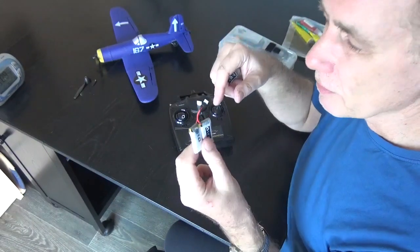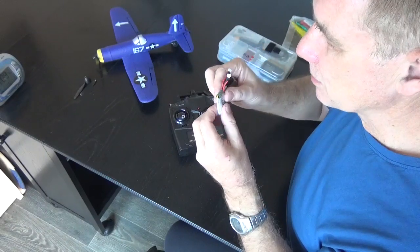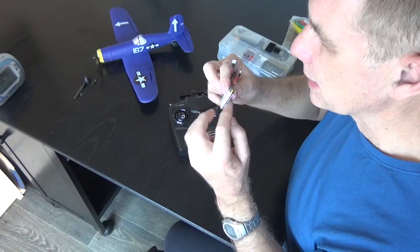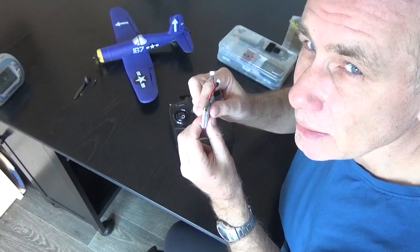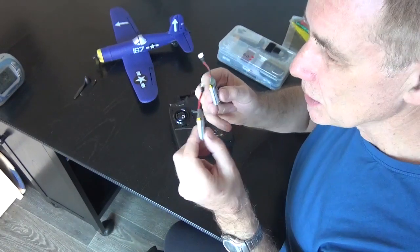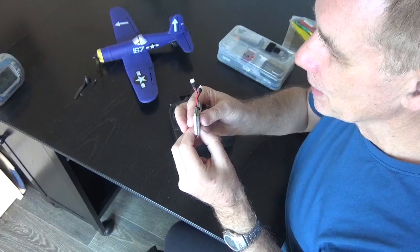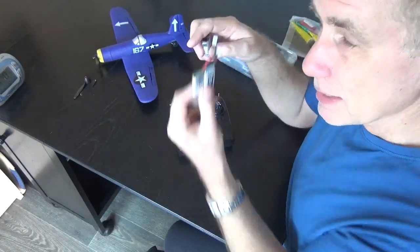If you run them right down to 3.2 volts, you need to store them a little higher than that. LiPos getting under 3 volts is not healthy for them. 3.8 volts keeps them alive and you can store them for a few months. If a battery ever goes puffy, dispose of it safely — find out how in your local area. Puffy batteries mean the chemicals are breaking down and creating gas, and when you charge them they may even catch fire. Charge them on a glass plate, ceramic dish, or tin, just in case — it's very low risk but good practice.